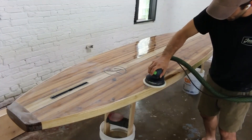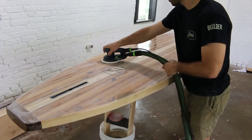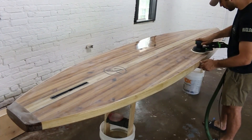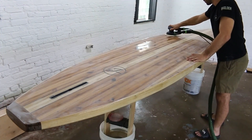To prepare your epoxy surface for varnish, it's best practice to wait until your epoxy 100% cures before adding your varnish layer, which can take around five to seven days in normal curing conditions. Waiting almost a week when you're so close to taking your board out on the water can be difficult, but I promise it will be worth the wait.